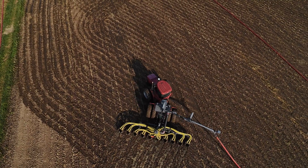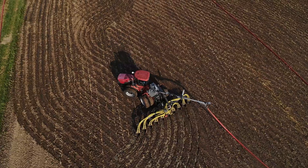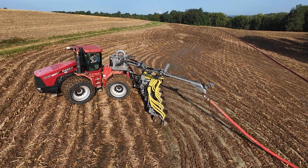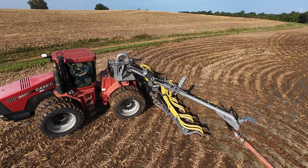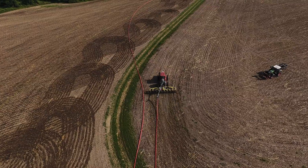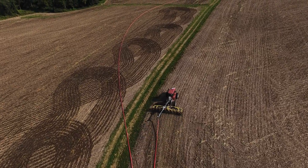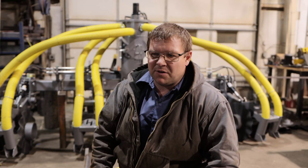This is the articulated with a tractor-mounted swinger and swivel row unit. This allows you to keep the injector in the ground the whole time, and with the swinger mounted on the tractor — basically piggyback — it allows the most maneuverability for turning around at the ends. You never have to stop driving, you just keep driving, you don't have to back up. It keeps your neighbors happy, it keeps DEP happy. This is a 30-foot wide with swivel row units.